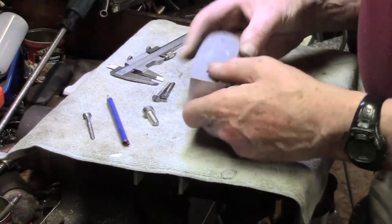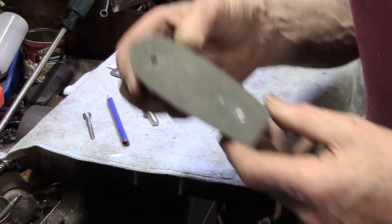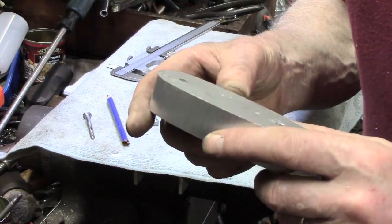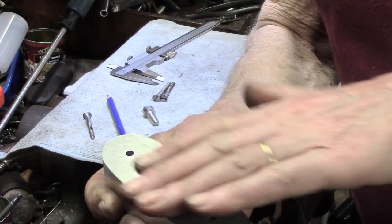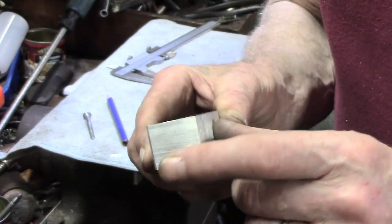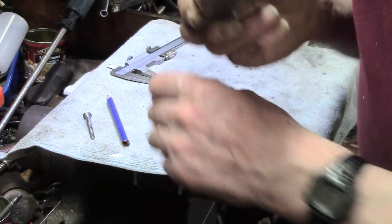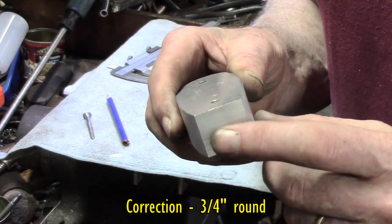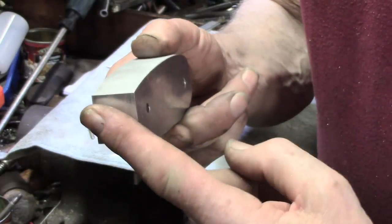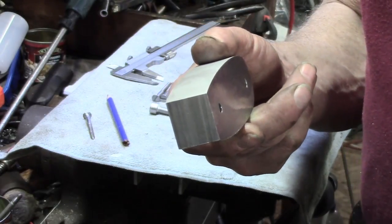It's quite a bit later. I keep picking away at this — each time I work on it, it gets hot and I've got to cool it off. We're getting fairly close to profile, just a little bit more to go and then I've got to start some finishing. The backside has got to be scalloped very slightly — I have to do that literally by hand. I think this square end is going to stay square because we're going to drill and tap that for a cap screw, and that's going to take a piece of half-inch round bar. I've got to mill some flats on that, so there'll be a butt hook — slightly adjustable. I'll move to the mill soon.